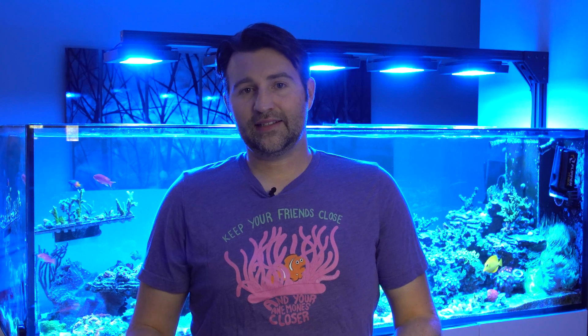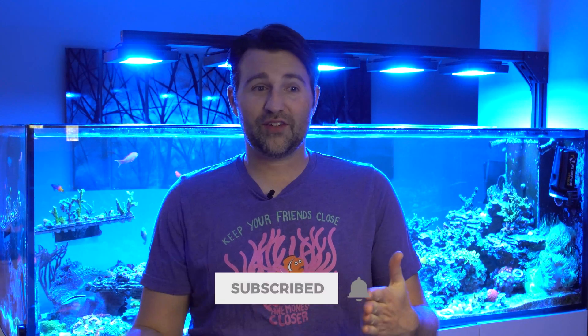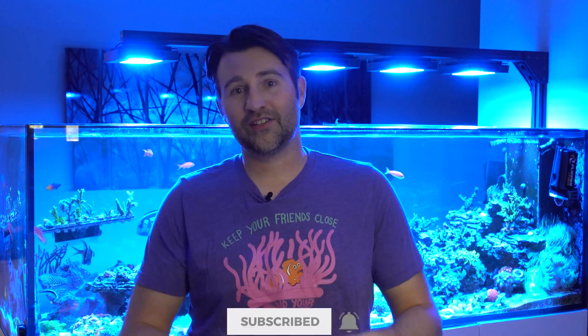A big question I get asked is: do you need an air dryer? With an ozone generator, moist air makes it less efficient. You can buy air dryers, but they're kind of expensive. The silica bead type pulls moisture out of the air, but every week or two you have to pull those beads out, put them in the oven, dry them out and recharge them — that got old after a while. Electronic ones are hundreds of dollars, which is hard to justify. My outlook is: I'm only running a small amount anyway, so if my generator isn't at peak efficiency, I can just turn it up a little bit more and save a fortune on an air dryer.